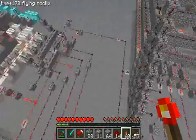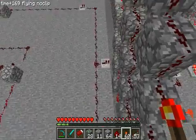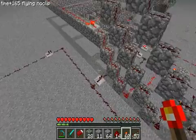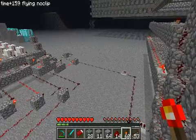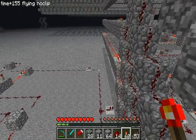I didn't mention this before, but the line that comes out of the opcode here actually goes into an OR gate with the clock. This just means that you can only load a value to a register if the clock is also low. This isn't really necessary, but it just helps sync everything up.